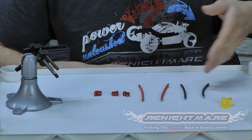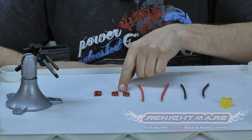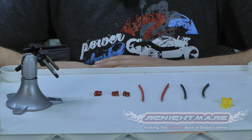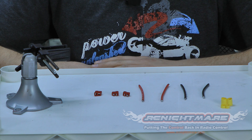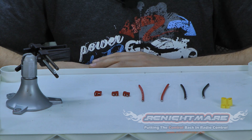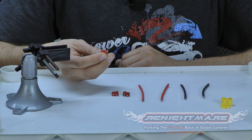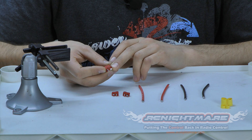I have all the things laid in front of me that you'll need to make it. You're going to want some wire — I have mine pre-tinned. You want two male Deans, one female Deans, and some shrink tubing. This is a little bit higher level of soldering, so if you're not too comfortable with it you may want to practice on some spare wire or try making the series connector first. There are a lot of different methods to build a parallel connector, all of them being a little tedious. The reason it's more complicated is because you have to connect two wires to one tab on your connector — in this case, Deans.